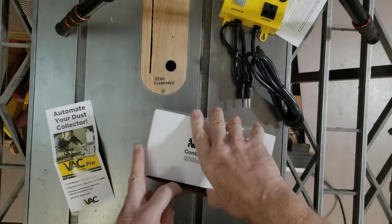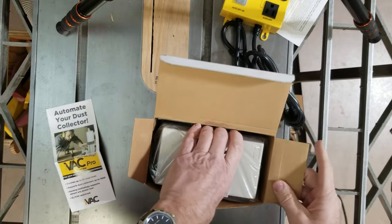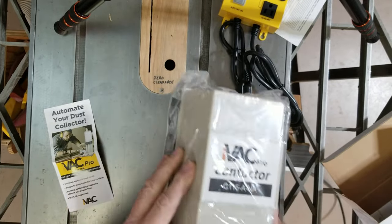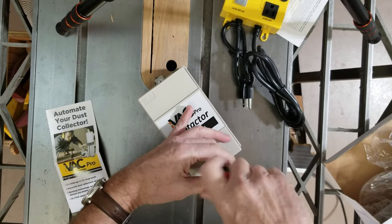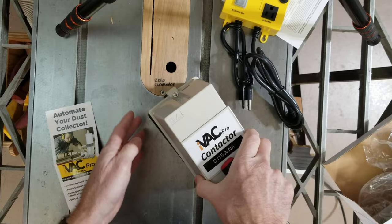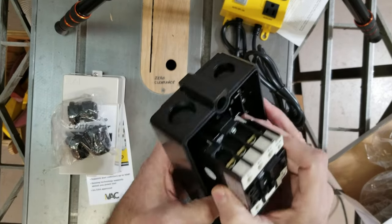Therefore, I need to add a contactor that allows me to control the higher 230 volts AC power and current with a lower input or signal voltage of 115 volts AC that will keep me from blowing the circuit breaker on the switch box. The contactor is basically a large switch that is controlled electromagnetically. It's similar to a relay, but bigger, as this one can handle up to 600 volts at 42 amps and can be used in either single phase or three phase circuits.